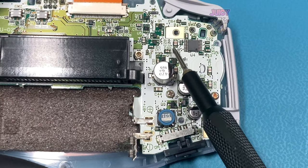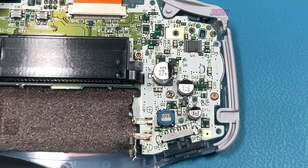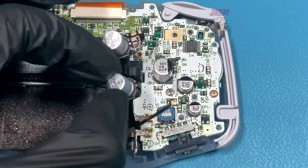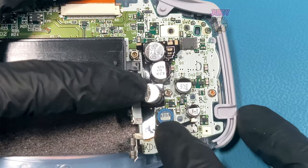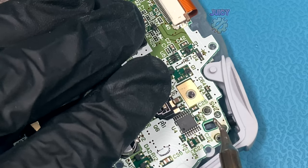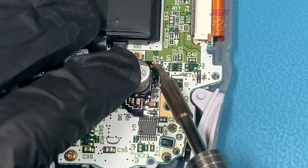Some of the points we'll be connecting to are the following capacitors. Some of these can be quite tricky, but the most painful one is probably the battery terminal because it takes up so much heat. To install, simply place your flex PCB over the area making sure to line up all the previously pointed out points, and then tack it in with a soldering iron. When tacking in, the joints won't be perfect but it's just to hold the thing in place.